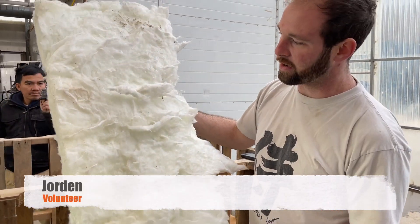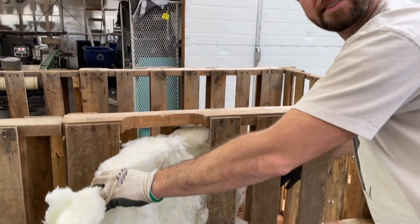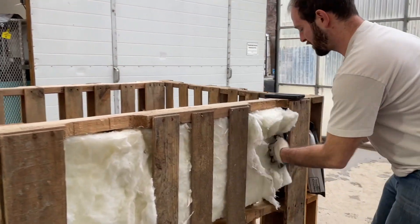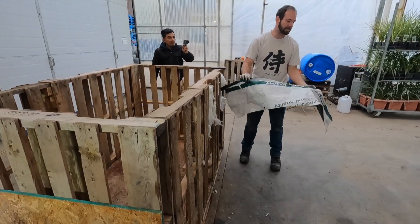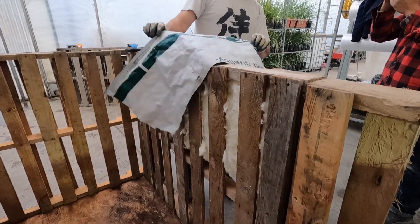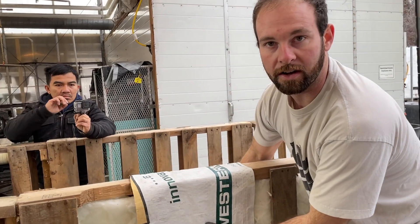We have your average fiberglass insulation here. It's best if you tear it into smaller pieces and cut it into even skinnier pieces than it comes in the package, so that you can slide it into the wall. This may not be necessary in warmer climates, but if you're dealing with cold weather scenarios, you're going to want some insulation in the walls — it's going to make a big difference. Tuck it in and spread it out. Once the insulation is in, take a material — we have lumber tarp, but you can use anything that will shed water. Putting the white side on the outside reflects sunlight; if you want it warmer, put black on the outside. White on the inside looks clean and you can tell if it's dirty. Staple it on over the outside of the pallet as water protection.